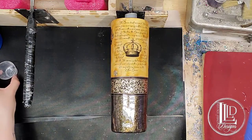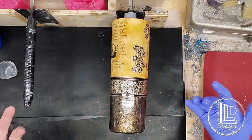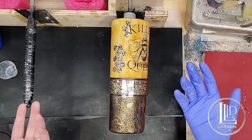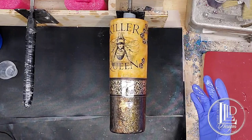I'm going to give this just a few minutes to sit — about five minutes — and this will once again allow any of those bubbles that are a little bit lower in the epoxy to come up to the surface. It will make it easier to torch and to get rid of all those little micro bubbles that might be in the epoxy that I maybe don't see now but you will definitely see in your finish when you're scrutinizing it later.